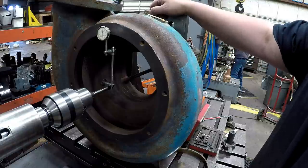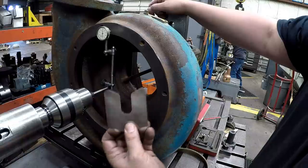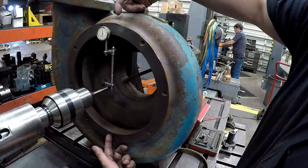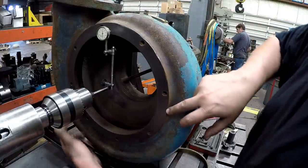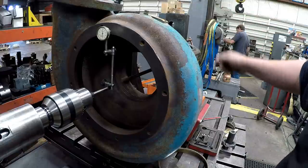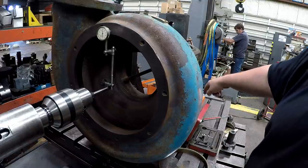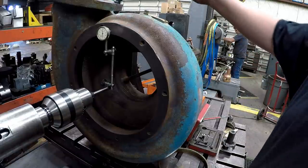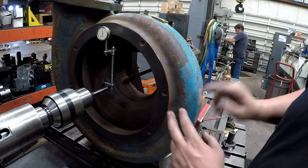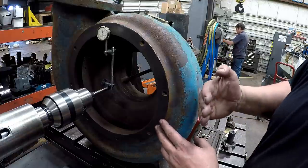I've already been doing a little bit of indicating because it takes a while to get this thing trued up. On the bottom end I've done some shims on these angle plates to get the top and bottom really close, but I've still got to get side to side. I've got this really neat clamp that I'm using to actually push this angle plate forward because this side's low, this side's high, and I'm using that to push it this way.